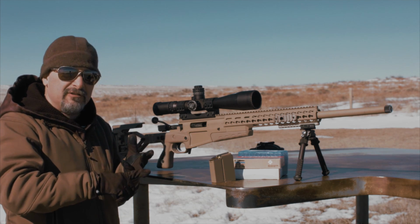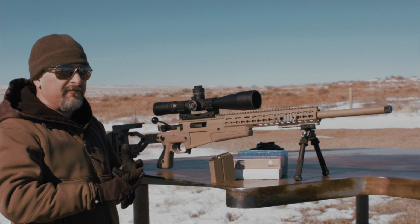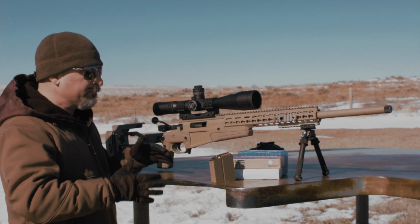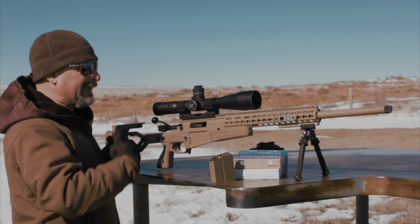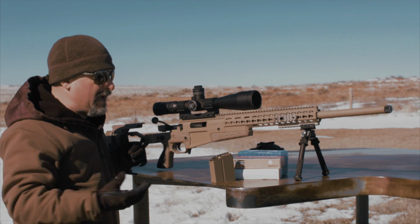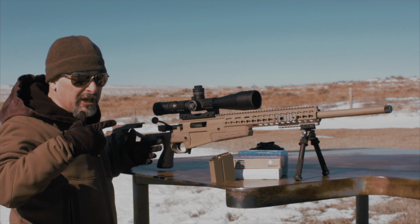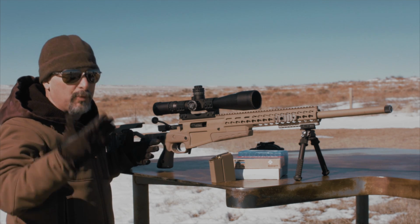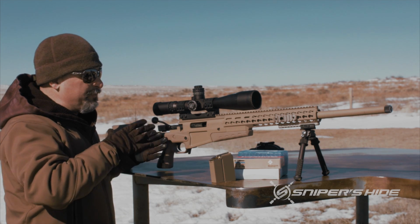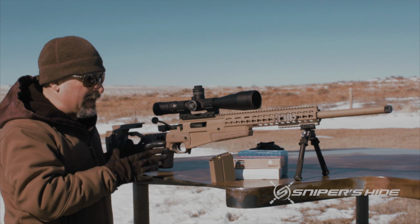So there's benefits to the shooter. There's benefits to not deforming the bullet by that skidding motion. There's benefits at longer distance by reducing the amount of drift. We're putting all this back in our favor. Why did they go to the right? I mean, that's the question you have to ask when they made barrels. Because the machines and gears turned to the right. Screws went to the right. So they just kind of did what they knew. They got away from the conventional thinking that a left-hand twist for a right-hand shooter.